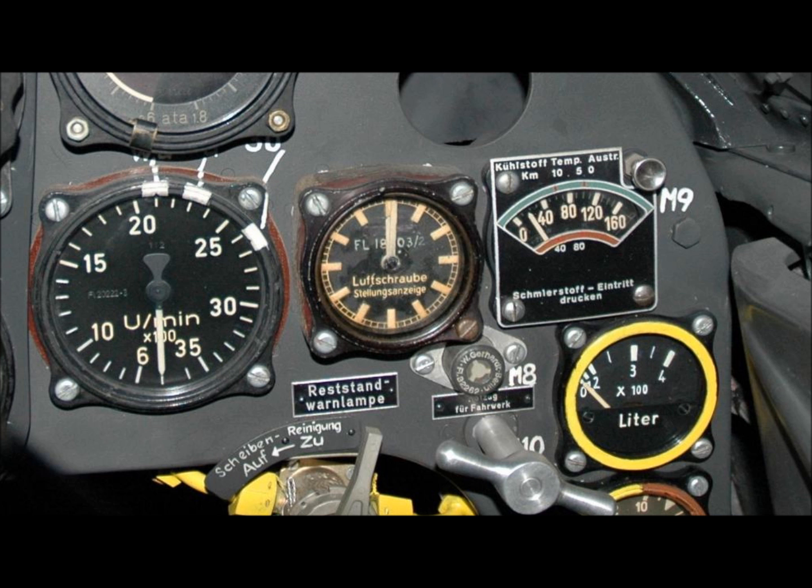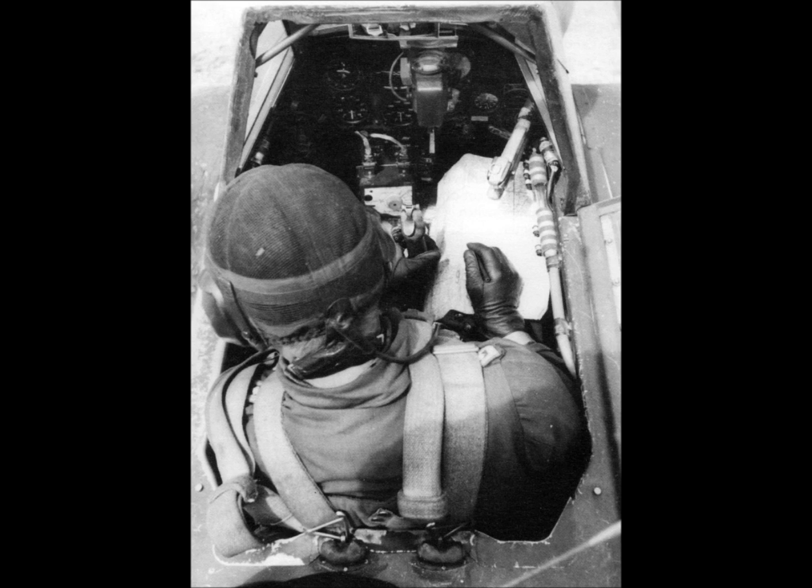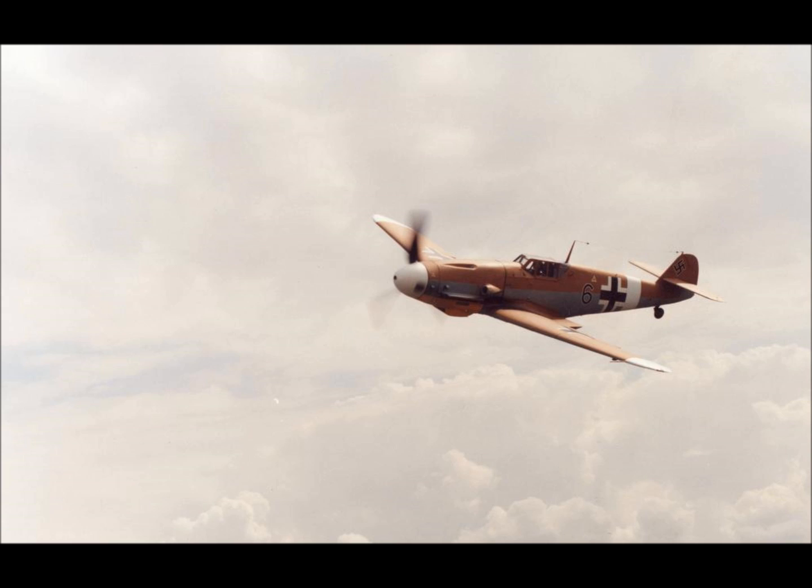For example, starting an aircraft with a propeller pitch lever, you would set the lever to the fine position and start the aircraft. With a thumb switch, the pilot wouldn't be able to tell the blade position without the clock. In the case of the 109G, the pilot would turn on the electrics, set the clock to 12 o'clock — 25 degrees blade pitch, which is the normal fine position for the 109 — and then start the engine. I hope this explanation has given you some idea of how the manual VDM propeller pitch system worked. In my next video we'll look at the much more advanced automatic system — thanks for watching.